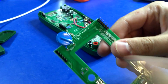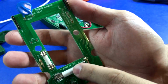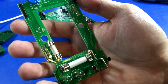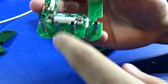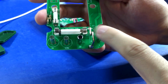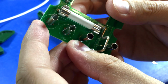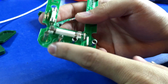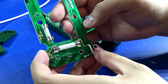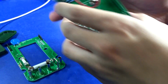That looks like a massive varistor, and that might be the first one we've seen that's got a varistor so far. Ceramic fuses, but they're pretty wimpy ones, so yeah. Nice looking current shunt. Looks like common and voltage are solid tube, and then there's the detection. Yeah, I think they have input jack detection on these two ranges, so those are split type, but it's really interesting that it's on a separate board like this that's modular, that you can just push down onto there. So that's actually pretty cool.